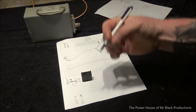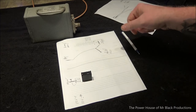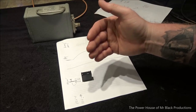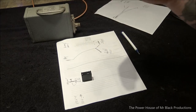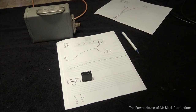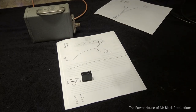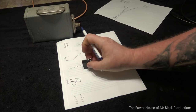He just wants to use it as a high-end receiver, and with SDRs, we have scoured the market, and there are very few SDRs out there that have a mute. And what I mean by a mute is not an audible mute. There are quite a few that have a mute on the audio side. We're talking about the VFO, to kill the VFO, and allow us to do that with an external trigger. If somebody would build an SDR that allows us to do that, so we have a physical wire that we can tie onto, they would sell hundreds of thousands of them, because all these guys could use all their old equipment but still enjoy the software receiver, the big panadapter, the waterfall, the ability to go digital. It hasn't happened yet, so now we've got to do this kind of quasi-Moto engineering.